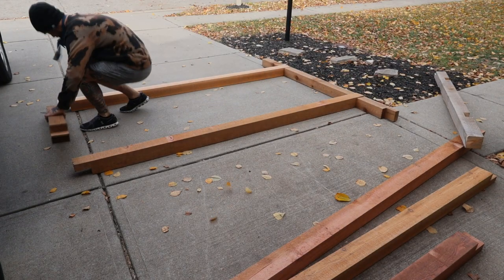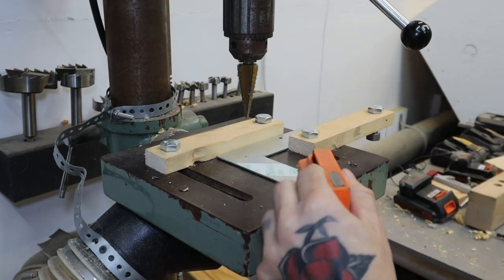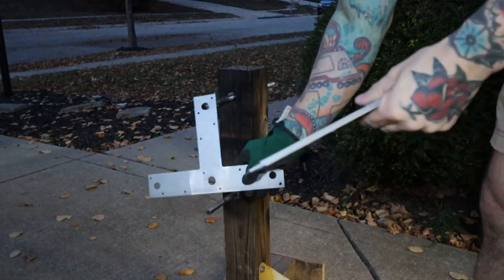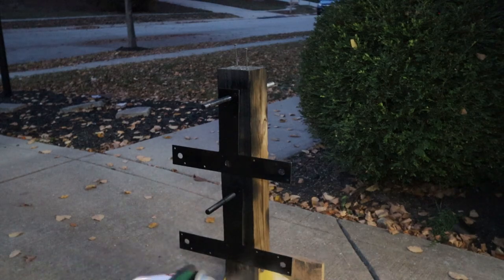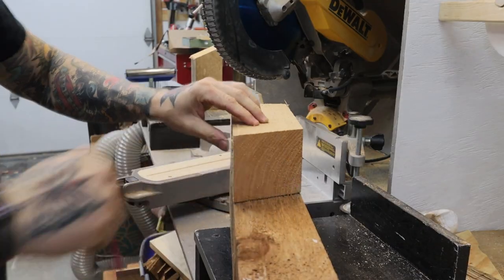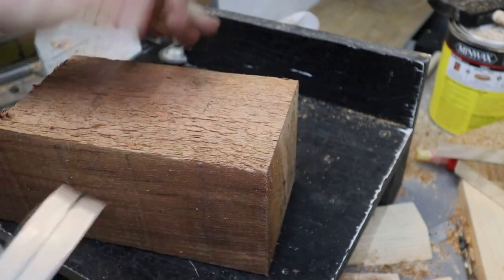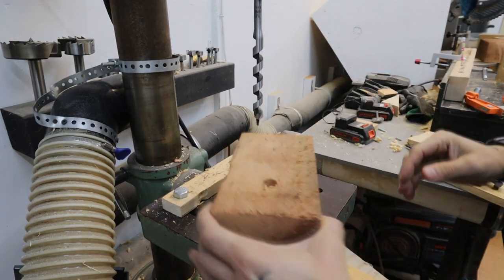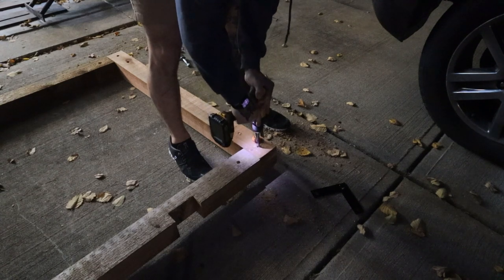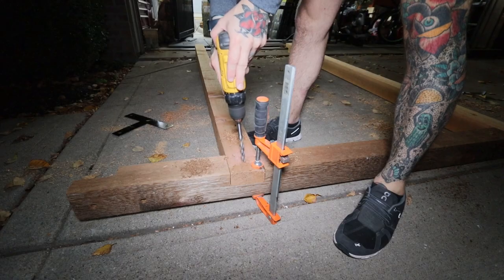Once I have everything cut, I lay it all out to test how well the pieces fit together. The left side looks good. Time to lay out the right side — everything matches up perfectly. I'll be reinforcing the lap joints with some T-brackets and L-brackets, and I need to drill an additional hole into each one. I do this with my drill press and a step bit. After doing that on all of them, I spray paint them black and let them dry. I only spray paint the front sides because the back sides will be against the cedar. Instead of using any sort of adjustable J-cups, I'll be using scrap pieces of 4x4 as my J-cups set to my preferred heights. I cut them to 9 inches and then mark the holes before drilling them out with my drill press.